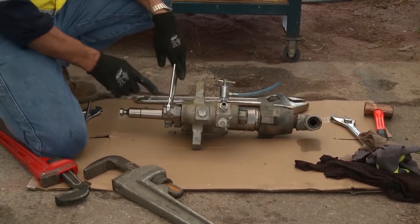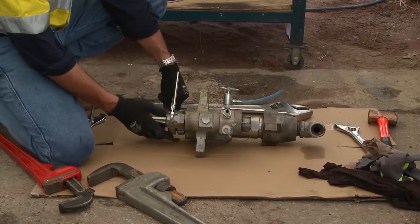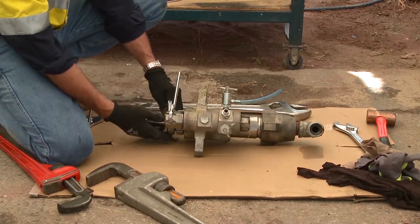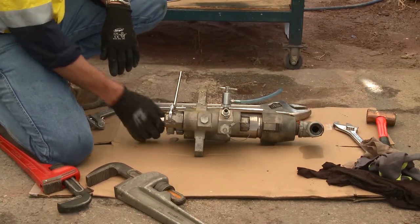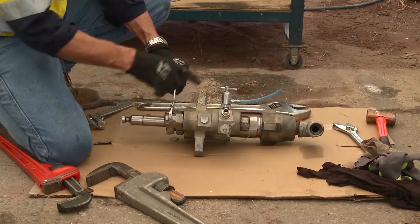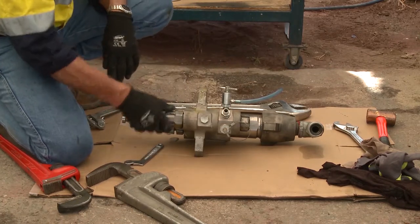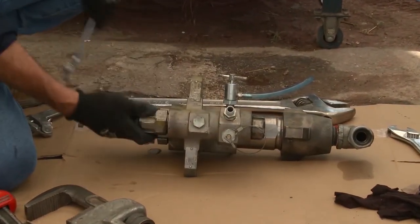What we're looking to do is take the torque off the piston or the packers themselves. You'll find that could be tight — if it is, you'll need to put a piece of tube on this to create a better fulcrum to undo the castellated nut. We loosen the castellated nut primarily to take the torque and the pinch off that piston. The other thing I suggest you do before you dismantle too much is also undo this particular filter housing — apply a little bit of snap torque and it'll come undone a lot easier.